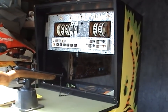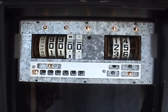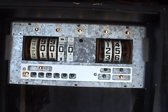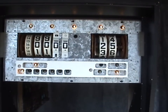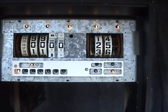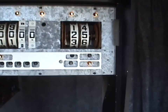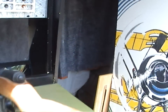With the glass pulled out we can see the score reels. There's basically one central motor to run all of the score reels. The left-hand side is your score, the far left is the number of credits on the game, and on the right are two digits for the number of shots fired — with a maximum of 25 shots. There are a couple of lights to illuminate the glass, and a couple of other lights to tell you what the high score is that you need to beat to win a free game. You can also see a bit of the play field down the bottom.